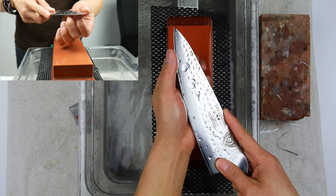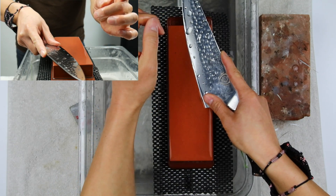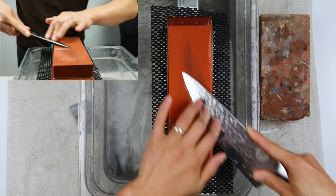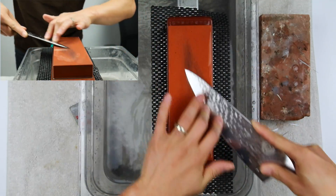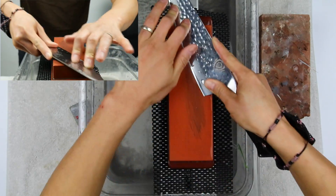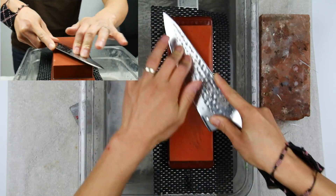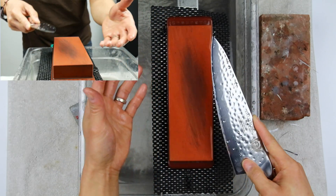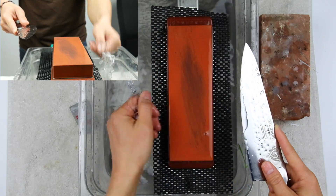This is how sharp the knife is — as you guys can see, very dull. Alright, we're ready to go. You want to take easy, nice smooth strokes. I am really not applying any pressure — only the weight of my hands. You want to move around the stone so you don't get into a situation where you're grinding the edge of the stone. I'm simply feeling for a micro burr on the left side because I'm sharpening on the right side, and I don't really feel anything at this point so I'll go a little further.